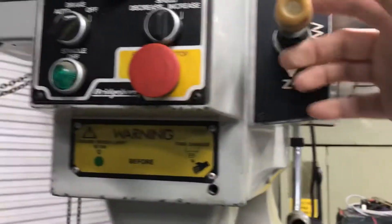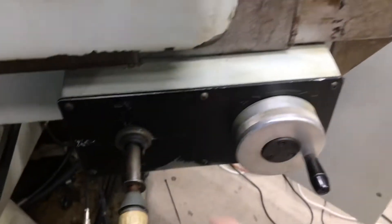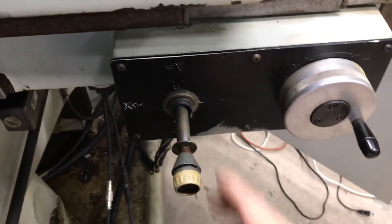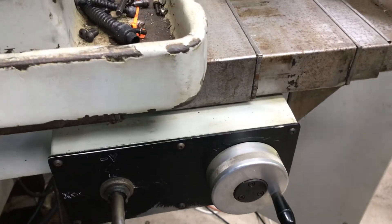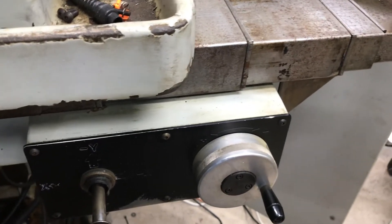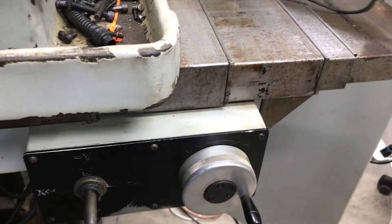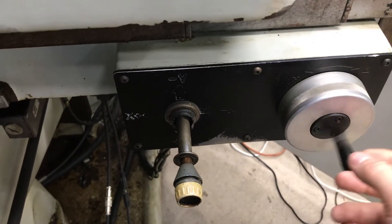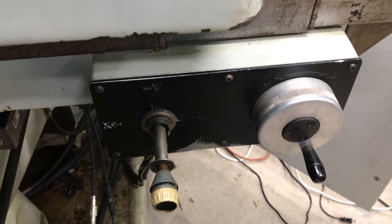As far as the Z axis up and down, I haven't got that figured out. Right and left — this is the one I've been using. I'm making a controller with a PIC micro and USB. I'm a little bit concerned because a lot of these commands use alternate commands like control and alt — the problem is if you don't get it out of alt mode, it'll lock up your computer. I'm going to take this apart and figure out how to run this into the spindle encoder on the Acorn.